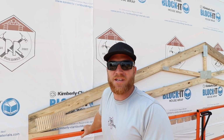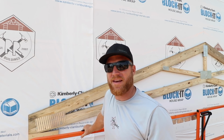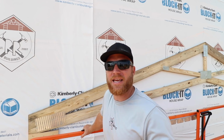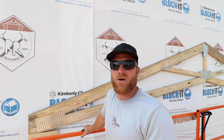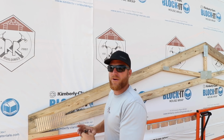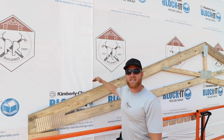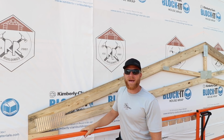Now, it's obviously a lot harder when there's really nothing here yet to put your trims on. If the roof was there, the steel was there, we'd basically just plane it in, get our measurements for our top leg of our trim, the back leg, and go to town. But none of that's really here. We're gonna have our purlins on top of the truss, then we're gonna have our sheeting, then we're gonna have our steel, then we've gotta consider the dimension of the back leg.